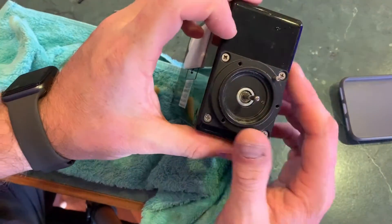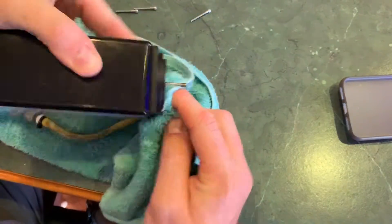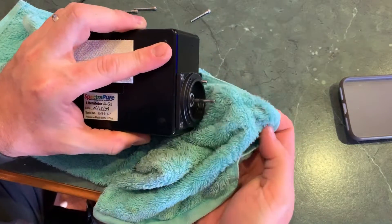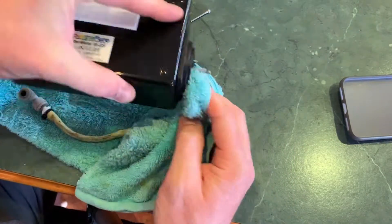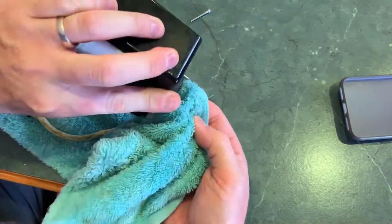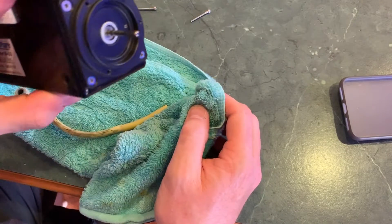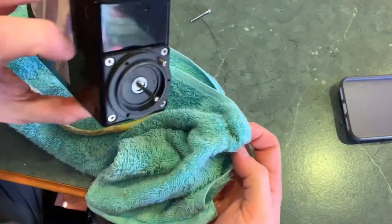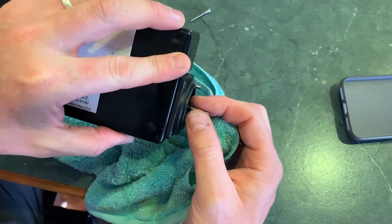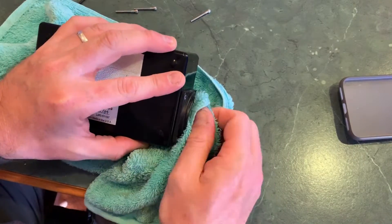So that's all three rollers clean. You can see I've got a little bit of gunk on the pump side itself, so I'll just give that a clean too. It's also worth making sure the shaft to the pump is nice and clean — that's what actually turns the rollers. You want it to be free of gunk so it gets good contact. I don't use any solvents or fluids; I just give it a wipe out. This one I've probably let go for maybe six months rather than the usual three or four, so it's just taking a bit more than usual, but it'll come up fine. There's a little bit of coloration on the shaft but I can't feel anything, so that's fine.